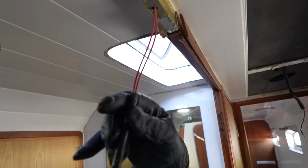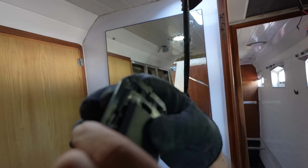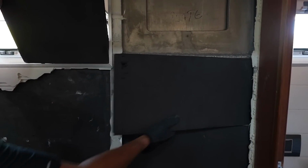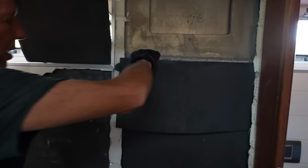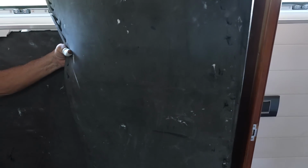We have electrical wiring for the DC, which also needs to be changed because it's going right through some places in aluminum without, I guess, any insulation. And then we have locations where the insulation was attached to the hull. Excellent insulation, excellent application, but there is an outer skin that we removed out of plastic, and that outer skin insulation should be a more dense type of insulation.